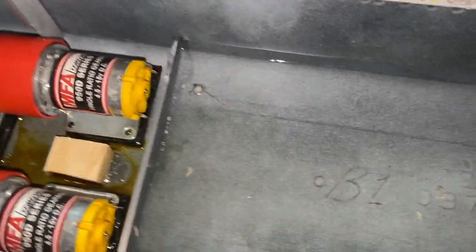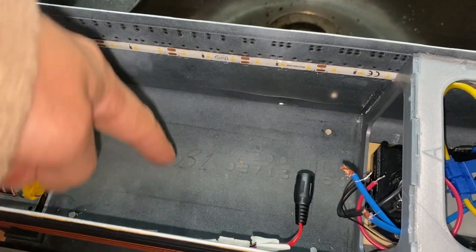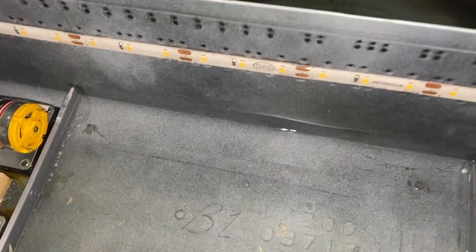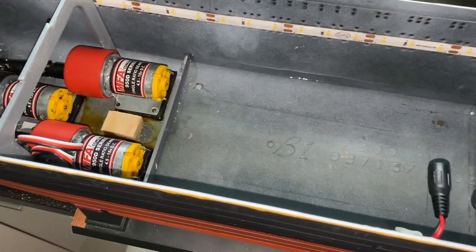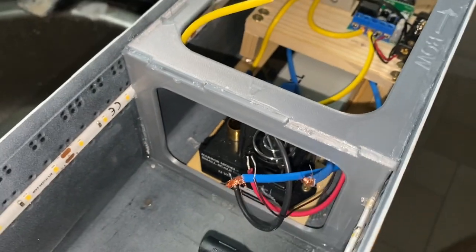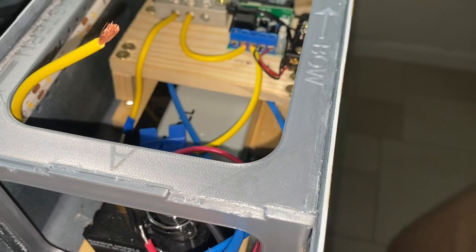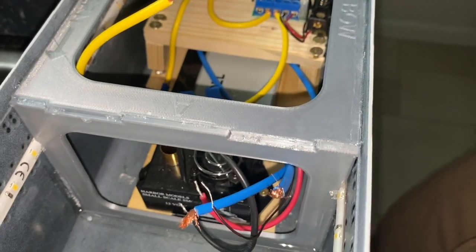So I've rather sabotaged one of the bulkheads, which wasn't going to fit into its correct place, which is around this sort of mark, because this is where my main circuit board goes. And instead, I've fitted it here. And it just provides a partition on the floor. I guess it does provide a little bit of watertight bulkhead separation, but the reality is it's not high enough to do anything serious. But it just makes sure that the oil won't get too far. And this is replicated here, where I've got my next watertight bulkhead, which actually is in its correct position. And the ambition here is to fill up this space with probably acrylic, so that this actually does provide a genuine watertight sort of door area.